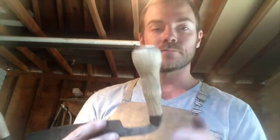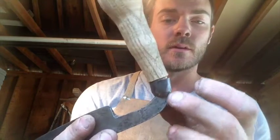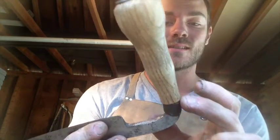And next one I do, I'll take that into consideration and leave the hole in my cap a whole lot smaller than this one. I ended up having to pound this handle on a little bit farther than the other one. And I ended up with a little bit of bend over there, which kind of sucks, but might be able to deal with it. But just to get the thing down far enough to have enough material sticking out that I could mushroom the whole thing down and fill the hole. But we ended up there pretty good.